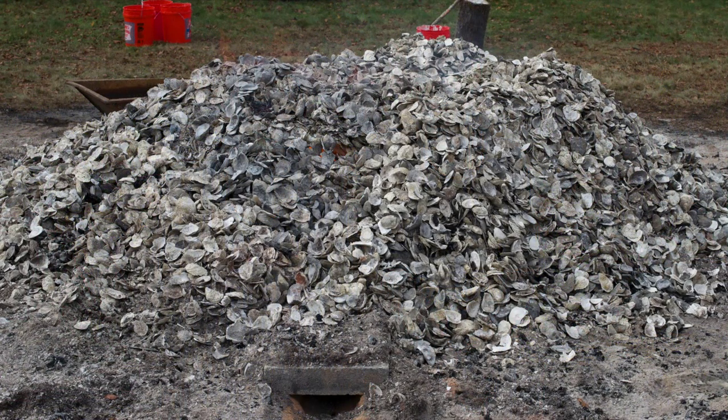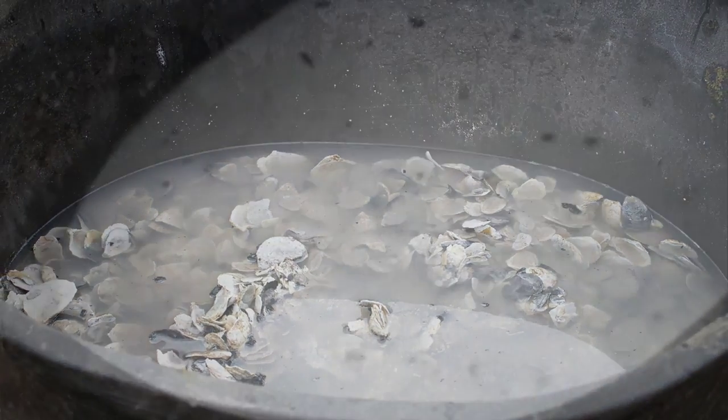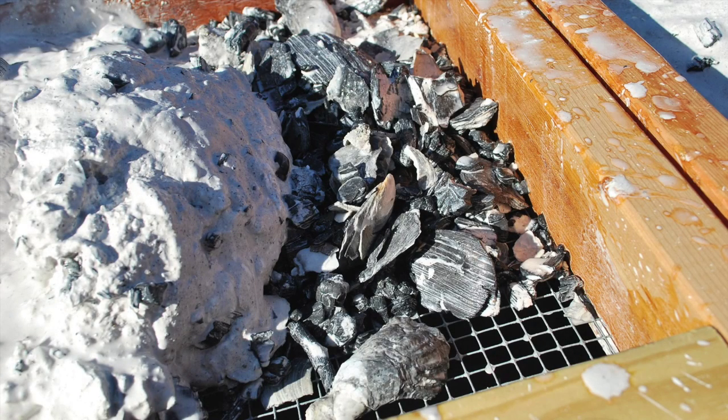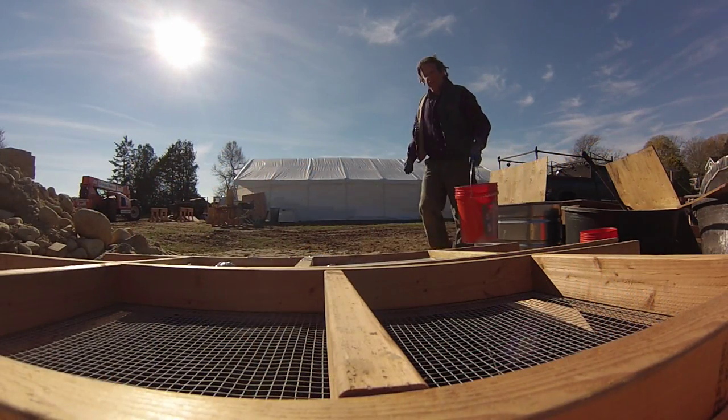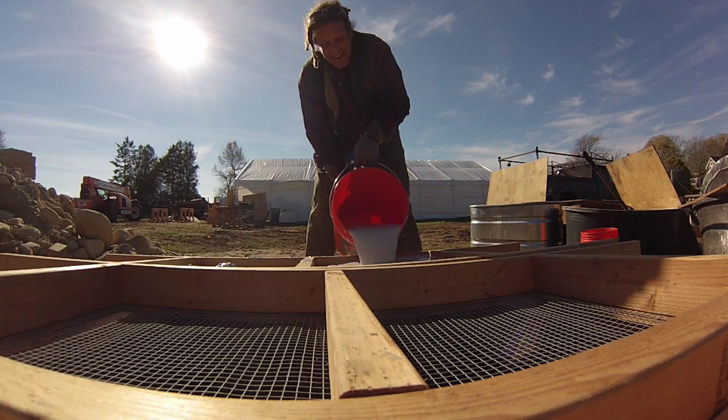Once the wood all burns away, only the shells and embers remain. The shells are then put into large bins of water where an exothermic reaction takes place, and the oyster shell breaks down and becomes slaked lime. After the exothermic reaction, the lime putty becomes very malleable — a soft white lime putty — but it still has lots of shards and pieces of unburned wood and oyster shells in it, so we run it through a screening process. As we screen the mortar, it drops down into what we refer to as a lime keep, which is an oak-lined hole in the ground where the mortar is stored.